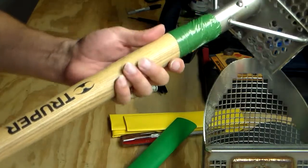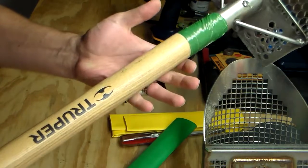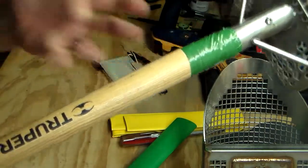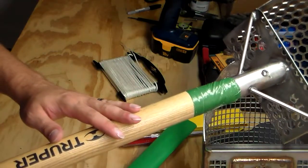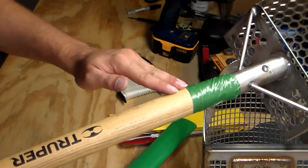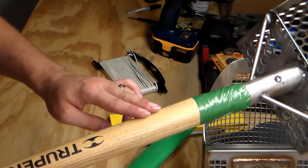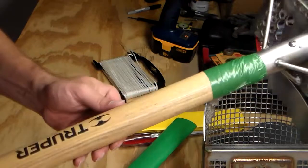The reason for that is this is coated in a polyurethane, and until this finishes off, that wax basically sits on that polyurethane and does nothing for you. It just rubs off on your hands. If you have that sticky wax on your hands when you're done using this after you've waxed it the first couple of times out in the water, it's because it hasn't penetrated into the wood. You're just wiping that wax right off. If you notice that when you put the wax on and it starts running, it's probably because there's a protectant already on the wood.